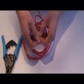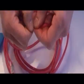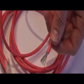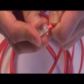Strip back two inches of the outer protective sleeve. Separate all cores and flatten and straighten as much as possible. Ensure the cables are in the correct order. The outer sleeve must be well within the crimp area of the RJ45. Trim cables back to the right length. Check the plug is the right way up. Insert and crimp.